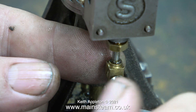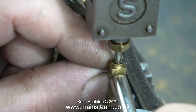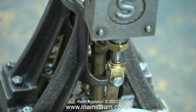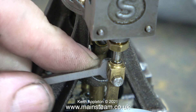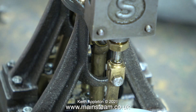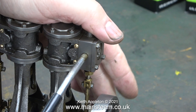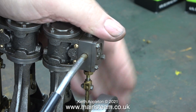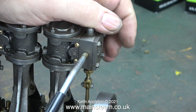I replace the steam chest in position, and here I'm refitting the pin that connects the eccentric rod to the valve fork, which in turn moves the slide valve. To prevent this pin from working loose, I'm tightening the lock nut at the rear of it. I haven't changed the timing, so theoretically it should work — it's still going to exhaust at each end of the stroke.